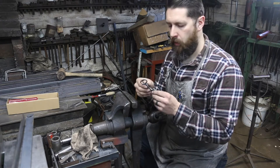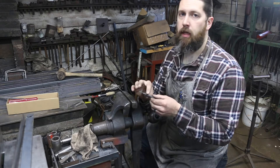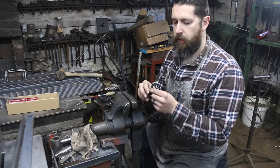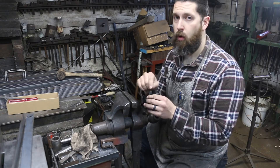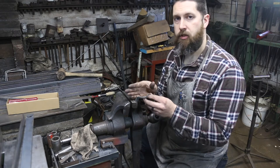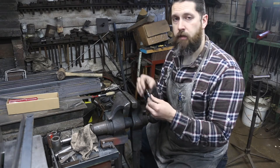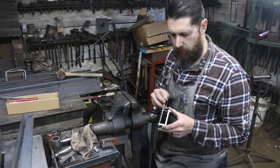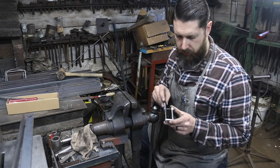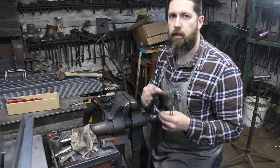With this key I'm pretty much trying to copy an existing key that I have. My proportions are a little off on the bow — it's a little bigger than I want. This stem right now I forged it to about 5/16ths; it's more octagonalized than round because if I kept forging it more it would have gotten longer than I wanted. So when I forge the next one I need to have a little less material there. Ultimately it wants to end up around a quarter of an inch, so there's not going to be a whole lot of material on the thickness of the wall. Having the 5/16ths allows me to adjust where it's off center — I can slide this key up and down and check the thickness at pretty much the whole length.